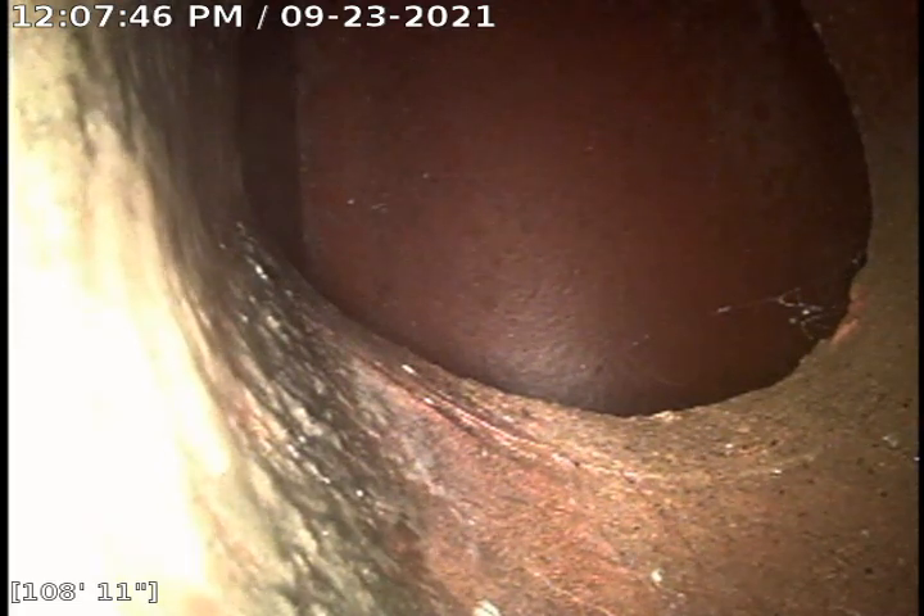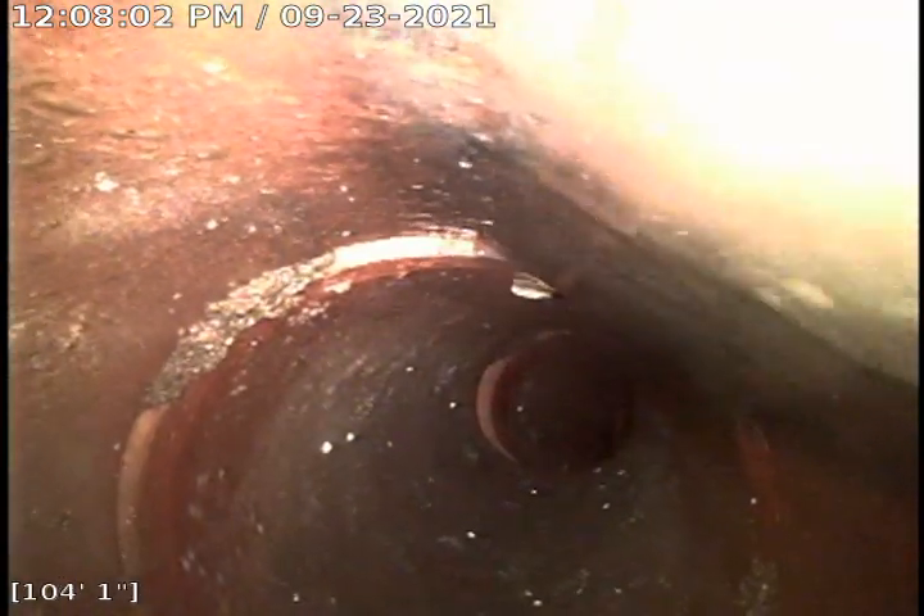I'm out of the city sewer. The line is 108 feet long. I'm going to start pulling back into 6-inch clay tile right here. There's an offset or something at 29 feet — I can't really tell, it's under water — but also there are multiple bellies in this line. My cable almost got stuck at that 29-foot mark, so I'm not going to put anything bigger down than my spade bit.